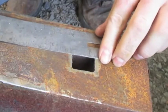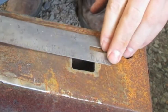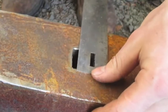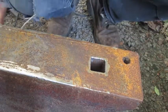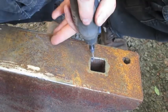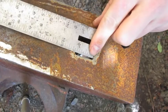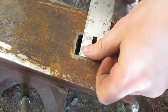Now I want a nice square hardy. Right now the hole was actually a little bit bigger than what I ground it down to, but I'm checking here to make sure that it's all square and going back and grinding out what I need to. The end result was about a sixteenth over an inch square.